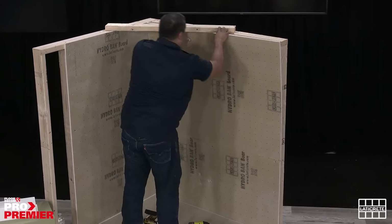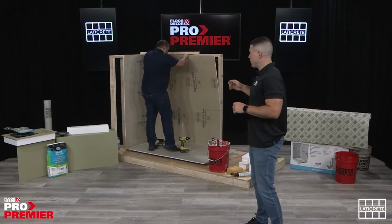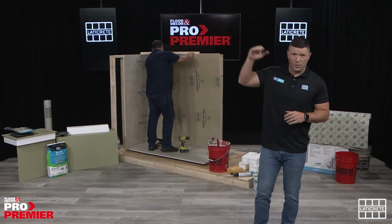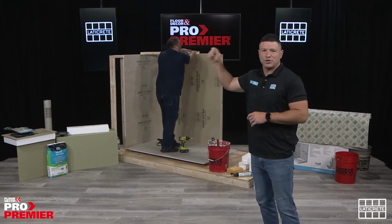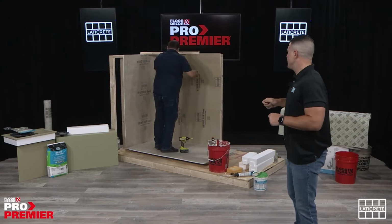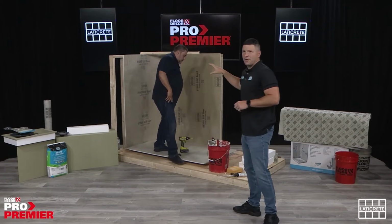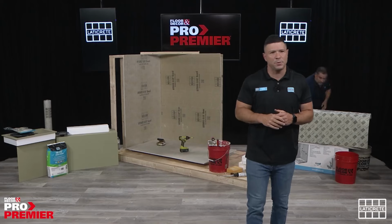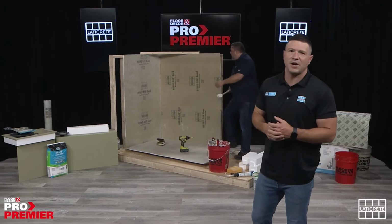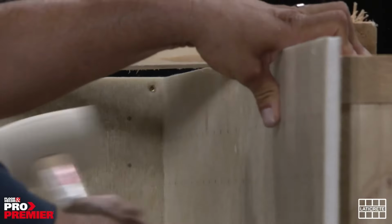So again, when you're stacking multiple boards, we're gonna follow the same rule of thumb as if it was one of the boards horizontally. It's every 12 inches you're gonna be putting a screw through, right? It's a little bit different in nature that you're gonna eventually have to treat that seam, but for the most part, a horizontally stacked board acts as the same as a vertically placed board every 12 inches. And again, the guide markers, the dots, they're there to help you, they're there to guide you.